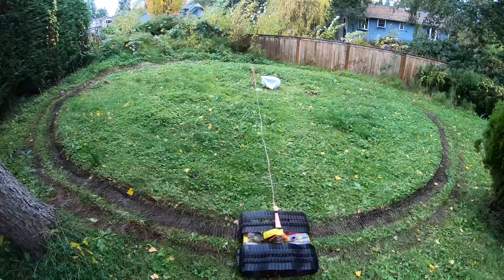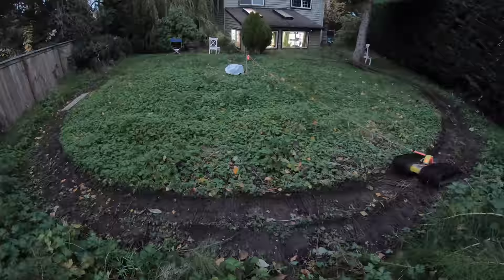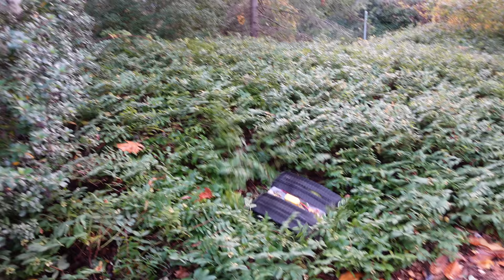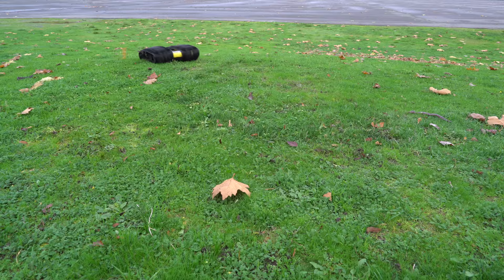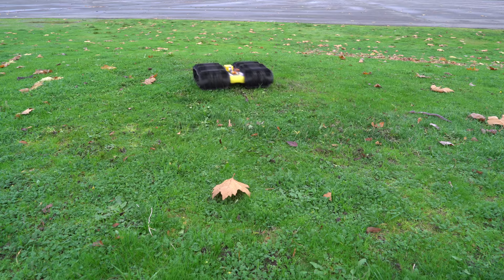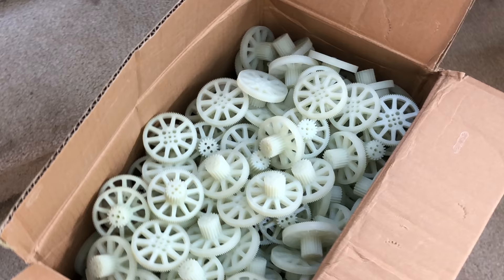After that whole week of driving, the nylon gears looked totally fine. But this is not super-fast accelerations — just constant smooth driving. So I figured I needed to do some thrashing to really put them through the ringer. I took it out and drove really hard like a maniac to try and break things, but it didn't break. So I'm really happy about these injection molded gears — they seem great. And they're super cheap since we have an injection mold. Each kit will contain two sets of them, so if you do break one — which I don't think you will, at least not for a while — you'll have a spare.